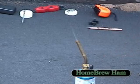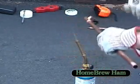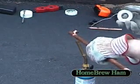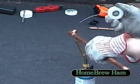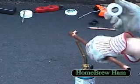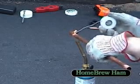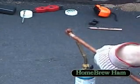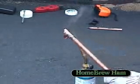You can see I've got the torch already going, I've got some solder, and this is the piece I'm going to actually join. So I'm going to present the piece to the flame. It's going to cook, and then I'm going to, when it reaches the appropriate temperature, apply the solder. It's not quite ready yet. Here we go. Starts to flow the solder. The job of the flux is to pull the solder into the joint. And there we go. That's that piece going.